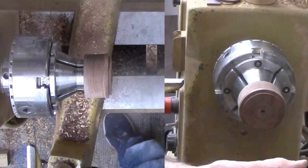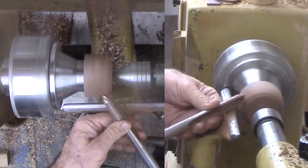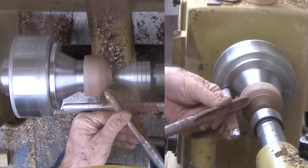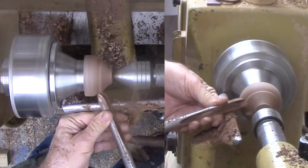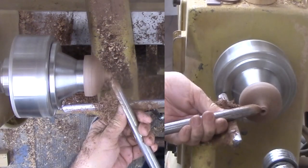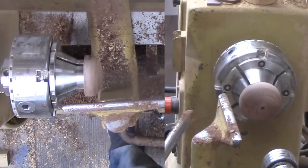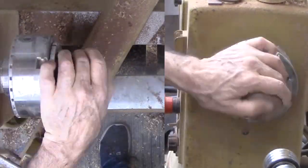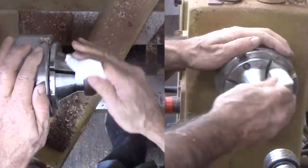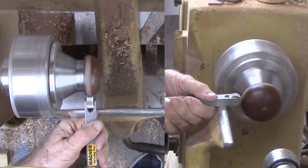After sanding, I can apply shellac friction polish to the inside of the cap. Now the cap is reversed for an expansion mount using the holes as a mortise. It does not take long to shape a smooth cap. After sanding and applying shellac, I use a Wagner texturing tool to texture the edges. It does not show up as much as I thought it might. Then reapply shellac over the texture — my order should have been reversed.